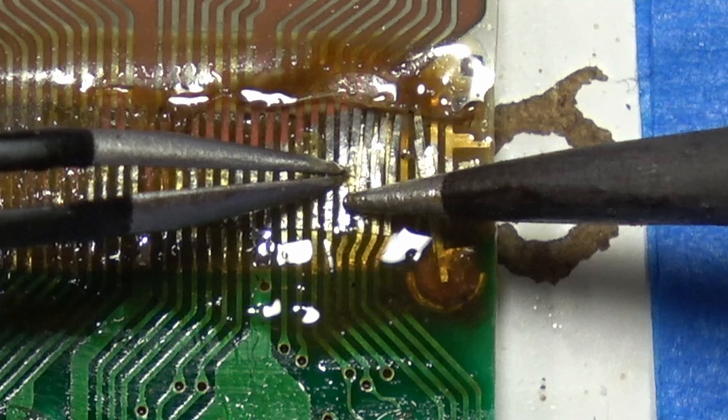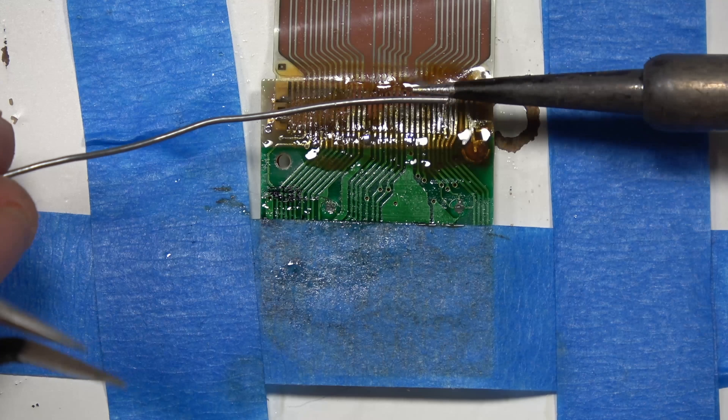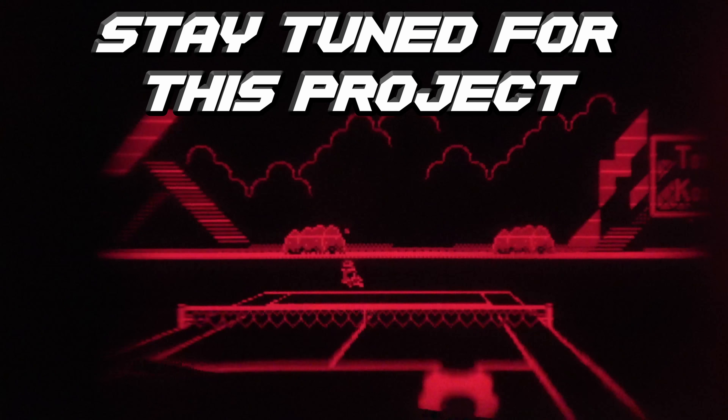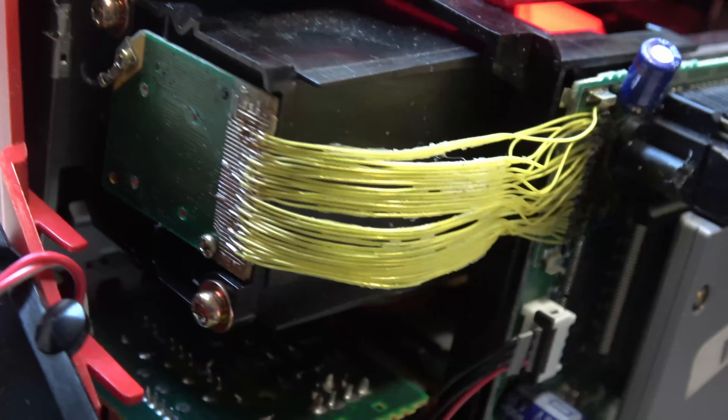I need to go in manually with tweezers, hold down each pin, and try to realign the pins that have moved — when they got bridged they got shifted. The pin right by the tip of the iron is actually underneath another trace. I'm holding each one down with tweezers and manually flowing each one back into place — it took a little while but there we are. If everything messes up completely, I'll make a video where you can actually just hardwire the entire thing together. I recommend that if you've messed up the ribbon cables and need an alternative.